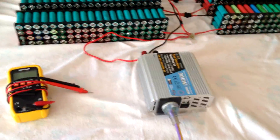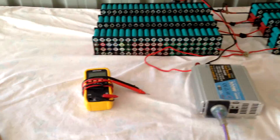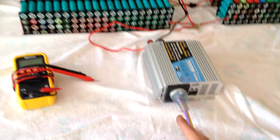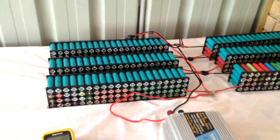The reason that happened is because my inverter wasn't grounded. Now that I've grounded it, I can touch here and then touch the positive and I don't get zapped anymore. If you are setting up a DIY Tesla powerwall, I recommend you ground it — for safety reasons it will zap you, and the zaps are quite painful. I'm not sure how many AC volts they are but it's definitely not good.